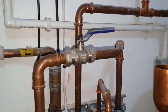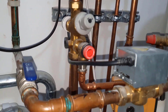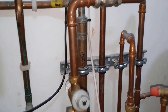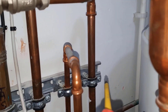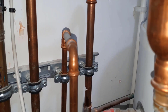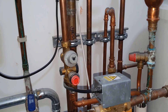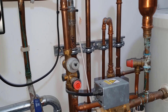The cold water inlet comes in through the pressure reducing valve and then goes to the cylinder at the bottom. The rest of the cold main coming in here is subject to a higher pressure, so the cold main going to the rest of the taps should also go through this pressure reducing valve. That means the hot and cold should be balanced at the same pressure — so that's also a defect.